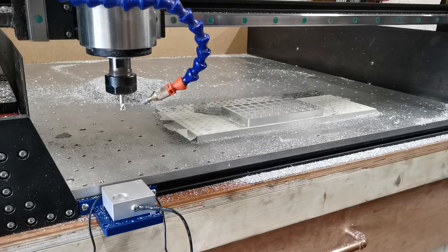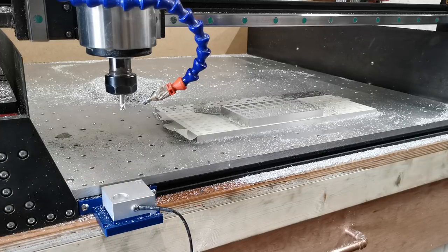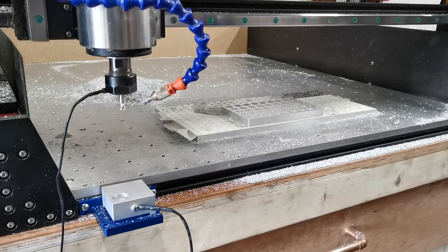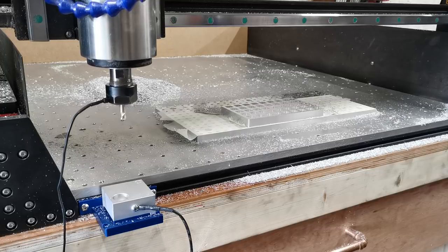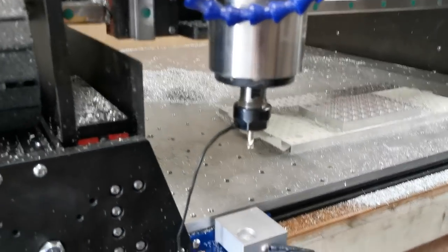Anyway, I've got my program. It's paused here because I need to do a safety check — I'm going to make sure my spindle is grounded. So I've got my magnetic cable on there, and it's grounded now. Move that out of the way and click continue. We're now going to probe Z — what we're doing is actually measuring the tool length here. So let's focus in on that slightly more.